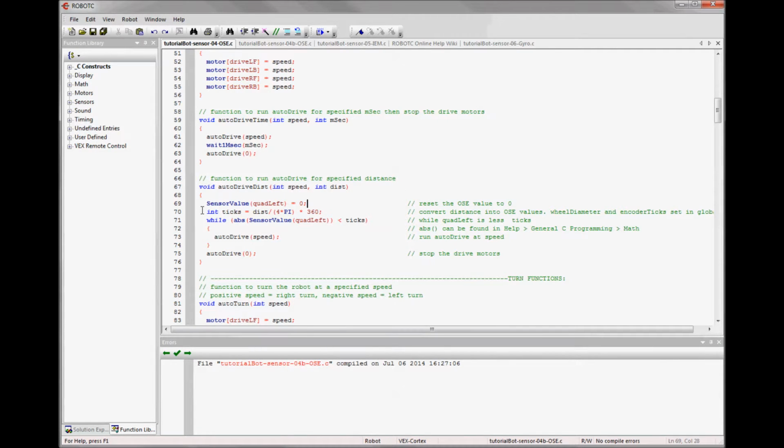What we're seeing is the effects of momentum. When we did our auto arm height, we saw that we had to account for momentum for the arm. The robot has more mass in the arm, and it's moving faster, and so we actually have more of an issue with momentum when we're dealing with drive functions. So we'll need to add something that slows the drive as it reaches the number of ticks that we want, and then stops it.